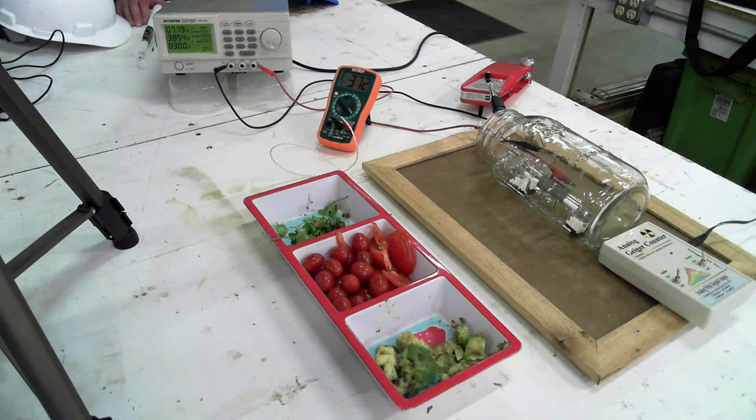According to the numbers I looked at in the table, it surprised me. Yeah. Well, I think the bigger danger is that if we get hydrogen in there at 50 atmospheres or 100 atmospheres, it's going to conduct heat just like metal. So the hydrogen gas itself will transport heat. That's why a close-fitting filler rod is important. It prevents the hydrogen from circulating to the cold side.